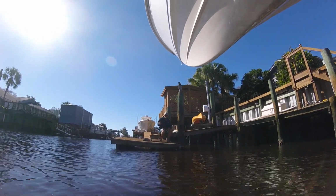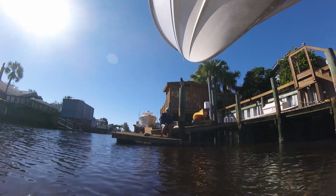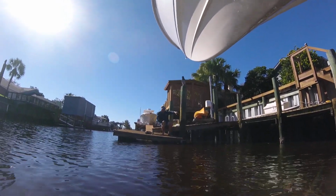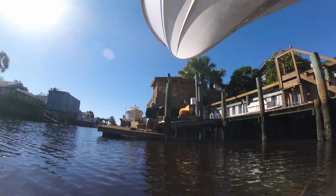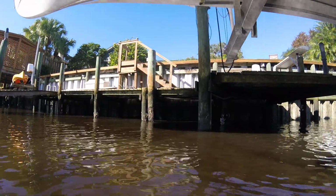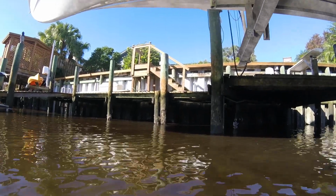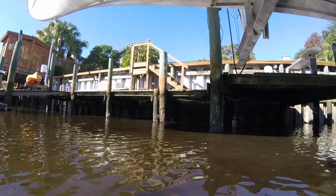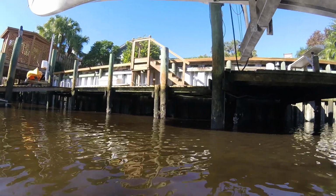The worse the piling gets, the more treatments it gets, all the way up to being concrete encapsulated like those 4. One more thing that Tom was talking about with those 4: you can see there are 2 piles kind of sistered there. The larger one is the one that would be getting concrete. That one beside it has some loss, but since it's tethered to the other pole, to save a little cost, we can beef that smaller pole up with the marine epoxy fill. So that one would be filled, and the one beside it would be concreted.